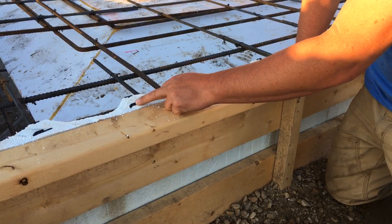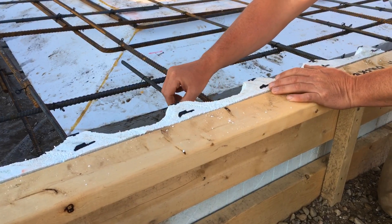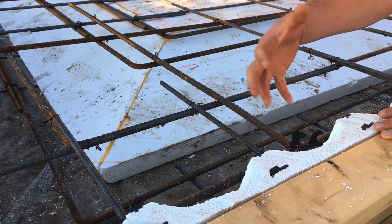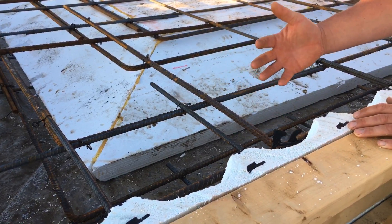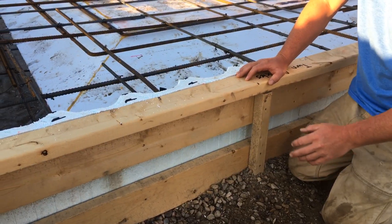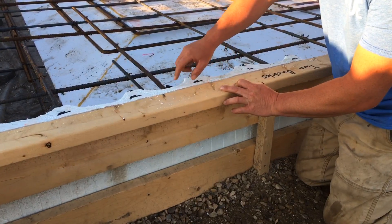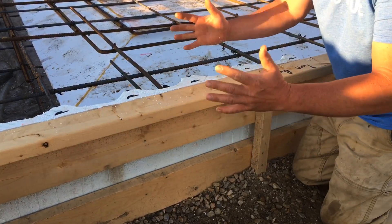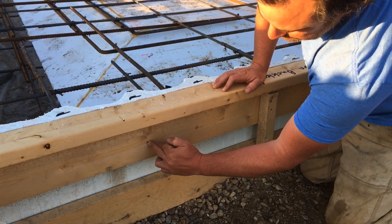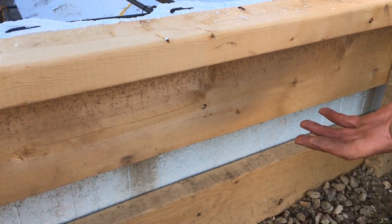Now if you're not familiar with ICF block, what we did is we just cut the block in half. This is an Adura block so they are collapsible. I have these little snap ties that are remaining and that'll help bond the block to the concrete. I'll get into the reason why we're doing this in a sec. You can see we had to cut through the snap ties — these snap ties are what hold the block together while you're pouring in a regular situation, but it also allows me to screw through my formwork into the block to hold it in position while we're pouring.